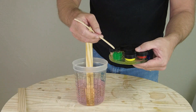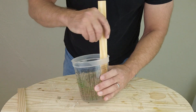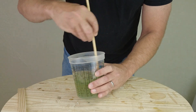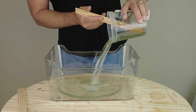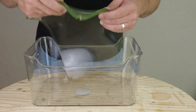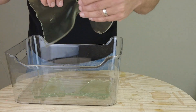Because this is a platinum silicone, you can use small amounts of silicone pigment to color it and still maintain transparency. Use very small amounts to get that glass color, because if it's too clear it looks like plastic. If it has a little bit of a green tint you get that Coke bottle glass look, or the look of tempered or safety glass. It does help sometimes to add a little bit of that — it just depends on the kind of color you're trying to match on set.